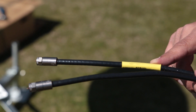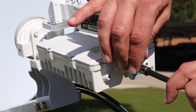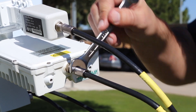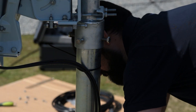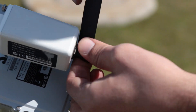RF cable connection. You may then connect the TX and RX cables, always leaving enough cable length in order not to overstretch them. The transmission and reception cables should be labelled TX and RX at both ends. Use the outdoor tie wraps, spacing them such that the cables are not left loose. Lastly, protect both connectors from moisture and rain by carefully wrapping them in self-bonding tape. If possible, connect one of the building's earth cables to the antenna mast.